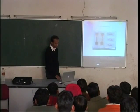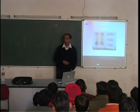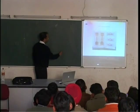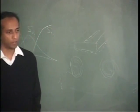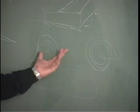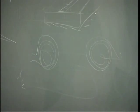There are all kinds of RFID antennas. Sometimes people use the term antenna a little misleadingly. For example, you may hear of an RFID antenna working at 100 kilohertz. It's not an antenna. At 100 kilohertz, what they use is one coil of wire on the transmitter and another coil of wire on the reader. And they call it an antenna pair. But it's actually the primary and secondary of a transformer. That's what it is at 100 kilohertz. So that's another kind of RFID. If you wish to call it an antenna, you can. Whatever it is, its main purpose is getting a signal across without using wires. A non-contact technique. This one is at 900 megahertz. There are three other frequencies also used.